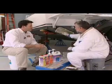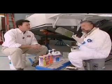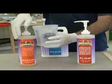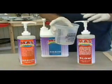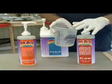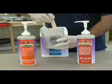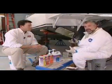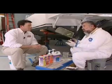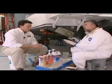Well, that's one of the main reasons that I really like working with your stuff is you have the ability to mix your catalyst. You can curtail whatever mixture you want. If you're looking for something to cure fast, you can go that way. If you want to slow it down a little bit, you can add a little bit of medium to your fast cure. Or if you want slow, you can go with slow, speed it up a little bit, you can add a little bit of fast. And typically a lot of these epoxy companies, they have these pumps. And you have to be pretty darn good at math, and you have to have a really good memory. Is that like 10 to 1? Is that 5 to 1? Is that 1 to 1? Yours is really simplified. Tell us about that.